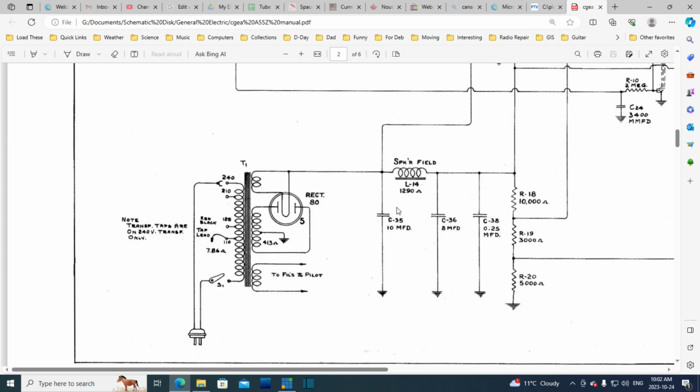There's a chance that that box, the square metal box, is actually two capacitors. And the two terminals are not a ground and a capacitor, but they're both capacitor terminals. And that's almost certainly what's happened here. So where's the replacement for this and this in the radio?